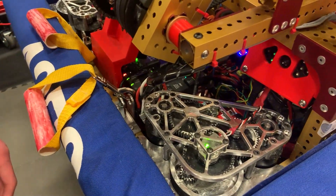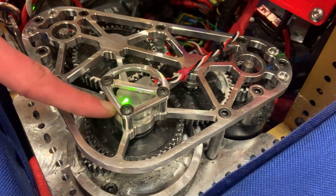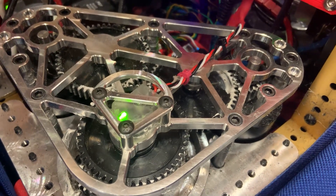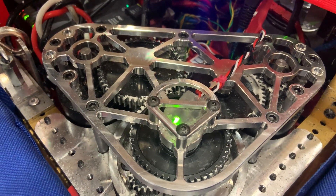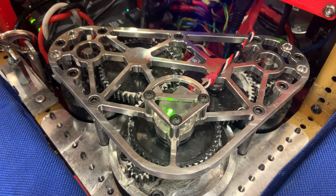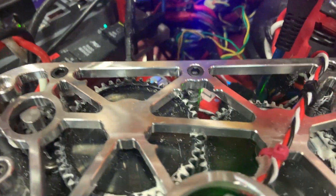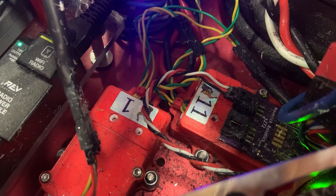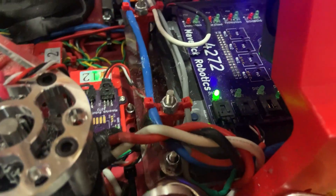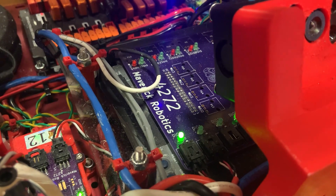We have four custom circuit boards on our robot. First, we have a custom encoder on top of our swerve modules and what it does is it senses which direction the swerve module is facing. We found it to be better than the CTRE ones because it does not utilize the CAN bus, which means there's less wiring and less things on our CAN. Another one is what the encoder plugs into — it's a SparkMax breakout board tucked in behind, and it allows us to plug in our encoders along with other types of limit switches without having them break. We also have an MXP board on top of our RoboRIO, which allows us to plug in all sorts of different types of sensors into our RoboRIO and also have things not break.